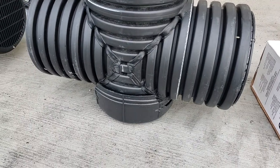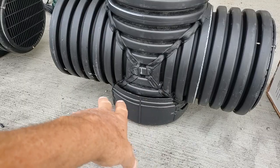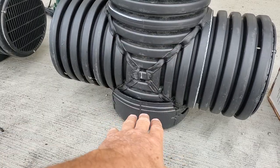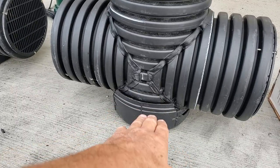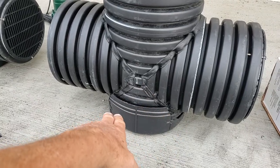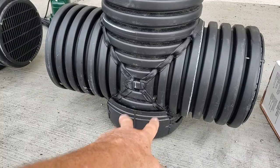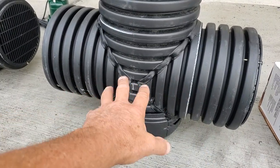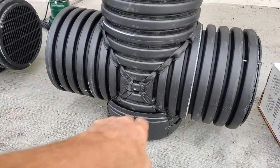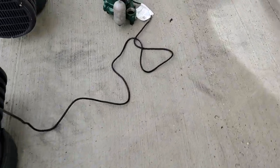You can also adjust the height of the pump. Just like indoors, when you see those really small sumps that fill up right away and the pump goes on repeatedly — pumps out the water, comes up, goes on — you can block up the pump, put something under it, get it up further into the chamber if that's what you want. If you want it to fill the chamber, that minimizes the number of life cycles.